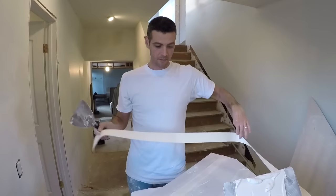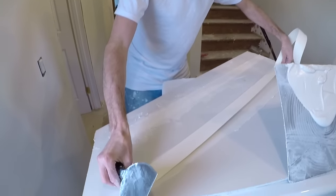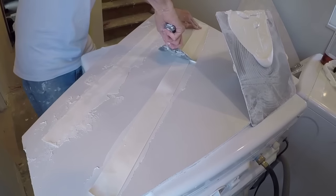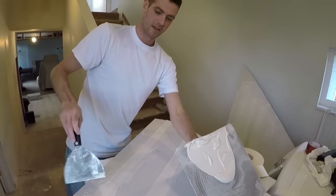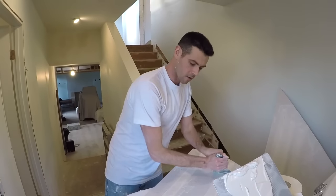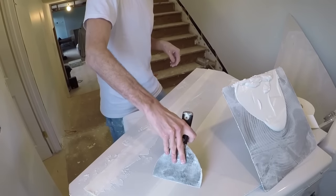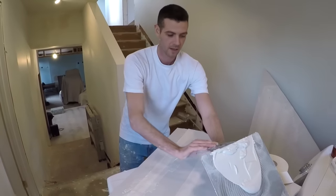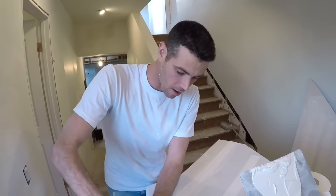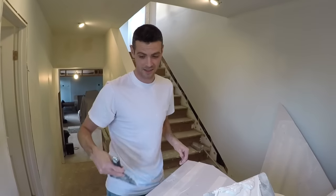You could really easily be spreading what looks like an even amount of mud but there's actually not enough mud under there. Now let's put that down and wipe the crap out of it. You want your tape sitting flat to the wall — building the wall out isn't an option with drywall, everything has to be flat, right? Wrong. Drywall is about making large, long, imperceptible bumps in the wall. Drywall is not flat, folks — know that.